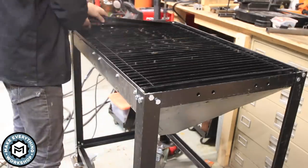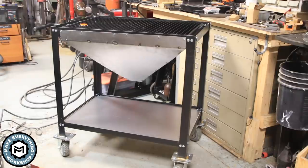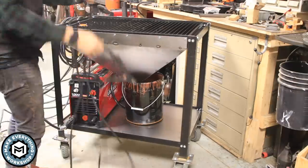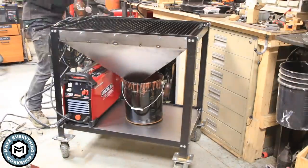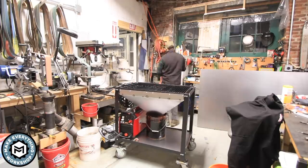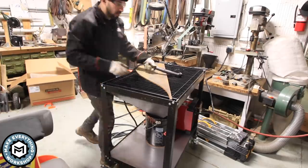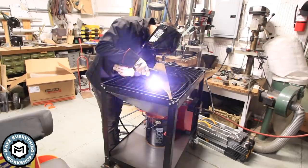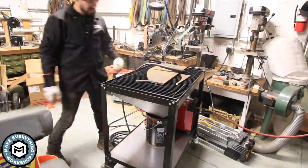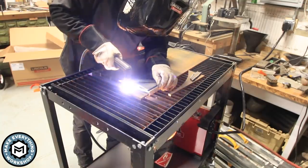I made a little wooden plate for the bottom and covered it in sheet metal — totally optional; you could just use a bucket on the floor if you're not rolling it around. I'm putting a steel bucket down there, once used for paint but now washed out and clean. My welder fits right next to it, and the collector also protects the welder from sparks. Testing it with the Tomahawk 1000 on a 50-amp outlet with my air compressor, cutting some 3/8" plate — all those sparks go right down into the bucket, exactly what I wanted.